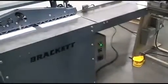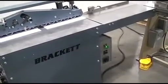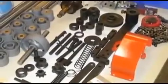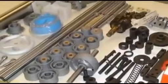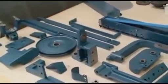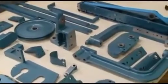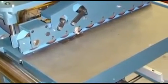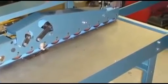The Bracket Utility is completely rebuilt in our shop. There is a new inverter drive put into it. There's a lot of work that goes into rebuilding one of these — completely disassemble the machine, all the parts are cleaned, sandblasted, painted, rebushed, reblued, whatever the situation calls for — and completely rebuilt by us. It comes with a new machine warranty.